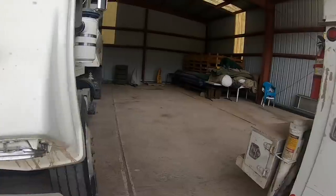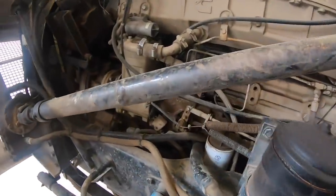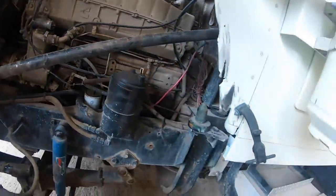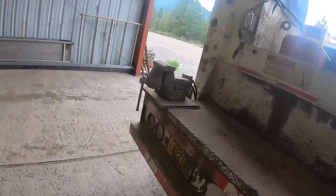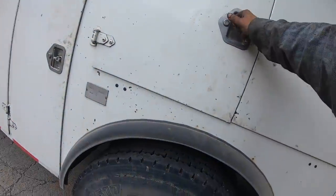At a TW25 Ford tractor that you saw there in the beginning of the video, that's going to be a pretty in-depth project, probably splitting it between the engine and transmission, pulling the cab, splitting the transmission from the rear end, and pulling that live shaft out of there.